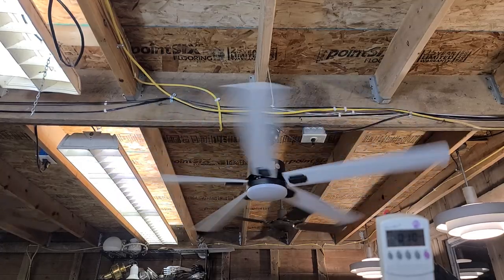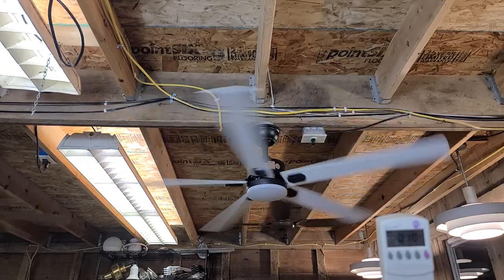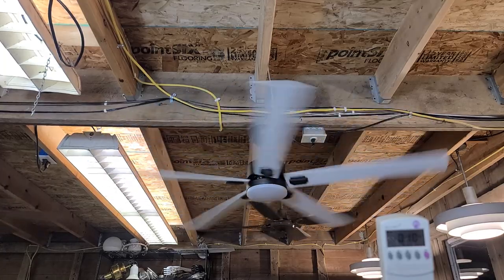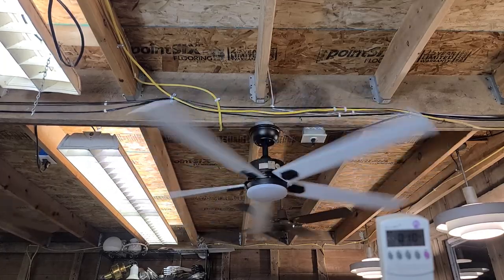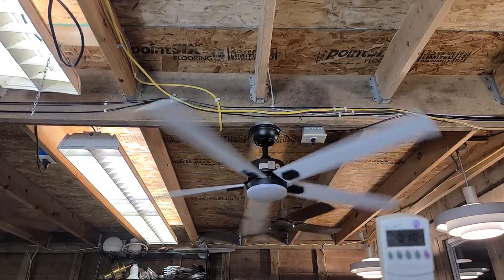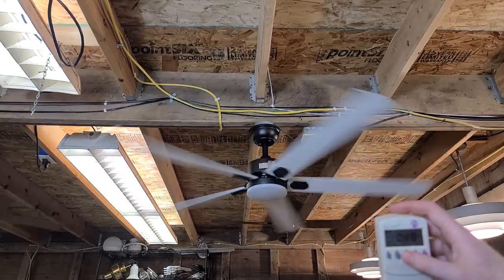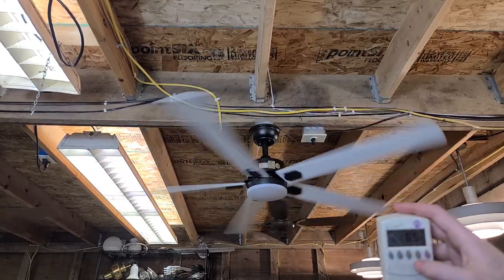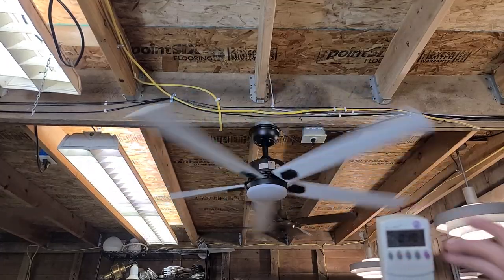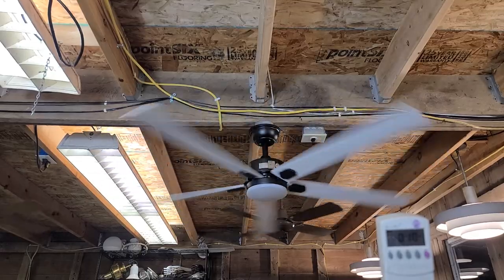Let's see, go with 480. Just going to average it. Okay. We're getting 96. Okay, so it was a jump. Yeah, no, okay, let's go to 3. Oh, I didn't do that. I forgot to. Yeah. 0.1 amps, 6.8 watts, so not even a 7-watt C7 bulb yet. It's interesting that this one is drawing less than the last one we tested, which was also pretty efficient, but... Yeah, okay, let's go to 3.